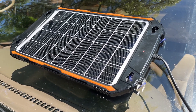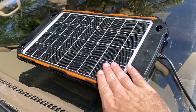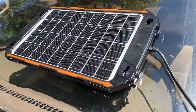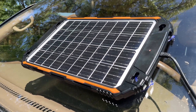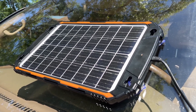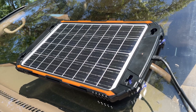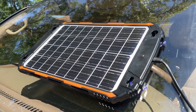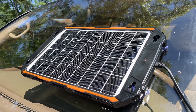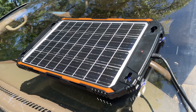As a battery maintainer this will work fine — you can just leave it plugged in all the time and it will top the battery off when it gets sun. I was getting around 6.5 watts on a 10-watt panel; many factors can reduce output, such as the sun hitting at an angle. Also keep in mind you don't want any shade on any part of the panel — even a leaf sitting on it could degrade output — and if mounted inside the windshield, make sure it's very clean. This is great for cars, RVs, motorcycles, or a shed with a riding mower, especially for vehicles stored for long periods. It's nice that it's waterproof, has a long cord, and comes with multiple connection options for temporary or permanent installation.